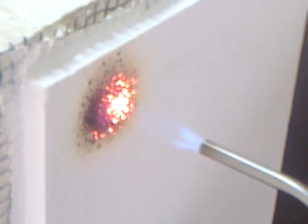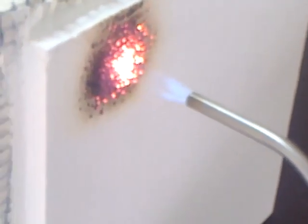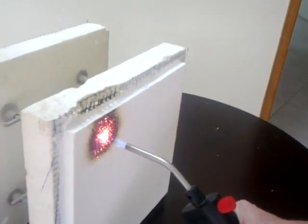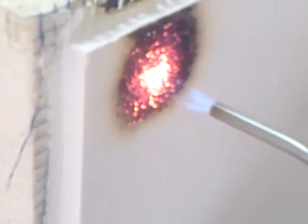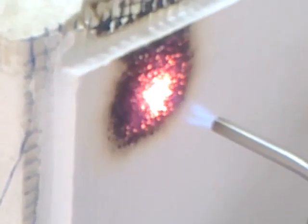At about 170 to 190 degrees centigrade, this paint will activate and it will start to bubble up and blister. It starts to become an insulator and it is designed to protect whatever surface it's coated. The very little smoke that is emitted is actually more like a vapor — like a CO2 vapor, a little bit of moisture coming out from the paint. You're noticing virtually no smoke, there's nothing to smell, there's no real toxicity involved.